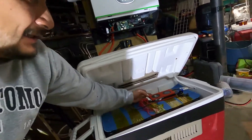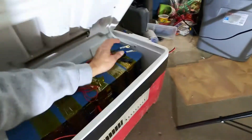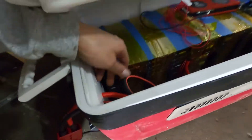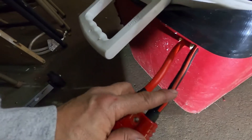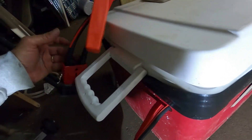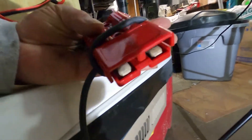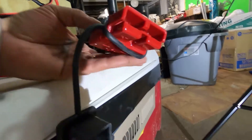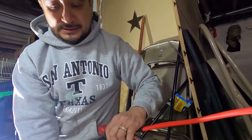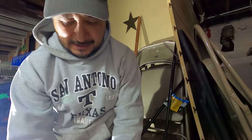So when I tried plugging it in — I plugged this in — this goes to the battery. The B minus goes to the battery, the P goes to the power. You see coming through here, I got the negative coming out, which is coming from the BMS — from the P minus on the BMS. Then I got the hot straight from the top. These are two-to-four gauge Anderson connectors. I got a video on soldering these Anderson connectors. I'm just going to show you my wiring diagram, but if it's upside down they slide off — these Anderson connectors.